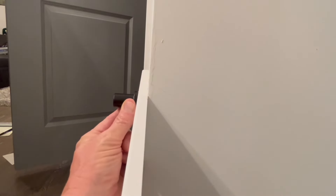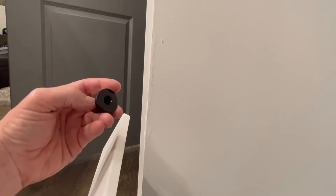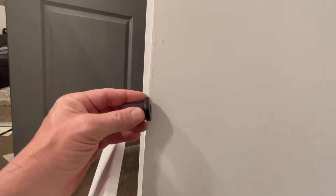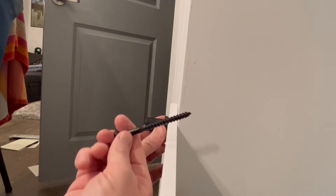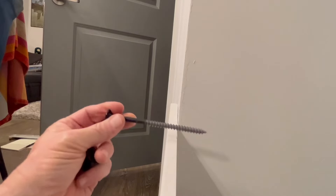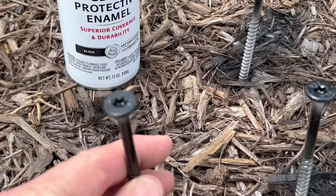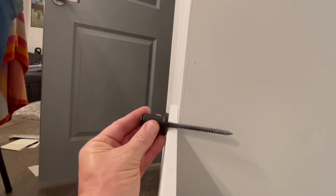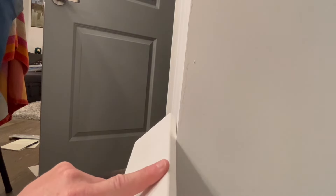Here's what I do: I buy a board that's three and a half inches by a half inch thick, cut it to the same length as the track, and mount it on the wall first. Then we mount the track on there and it will not push into the wood. You could also put big washers behind the spacers, but those don't always work and they don't look great — and if you've already damaged the drywall, washers will just make it worse. So now I've got my board on, and instead of using the four-inch screws they give you, I use big lag screws — construction lag screws that I even spray paint black so they match.